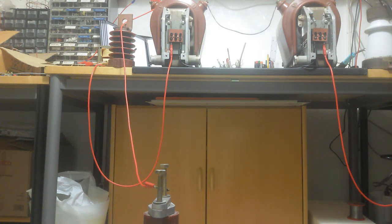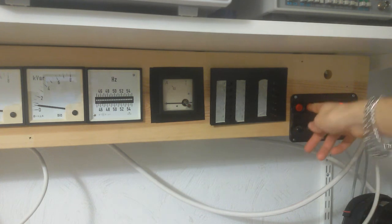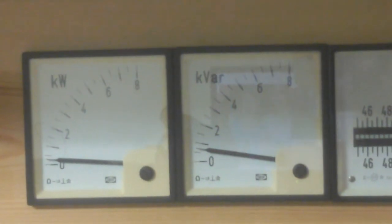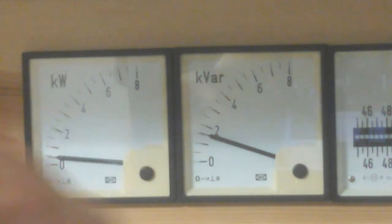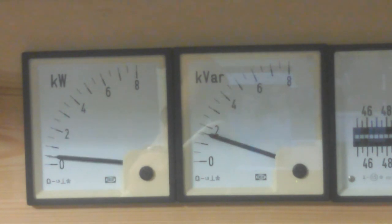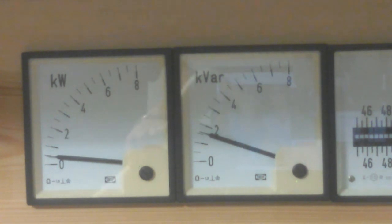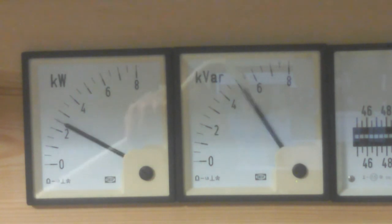And now they are turned off. Let's have a look at those meters. I'm going to turn on that one and then turn on that one — let's watch the meters: kilovolt reactive and kilowatts. That's another transformer — almost no kilowatts here, nothing. But look at that: there's a lot of wasted power right there. I'm going to pull the arc. And now I'm going to short it. That's a lot of reactive power that doesn't do anything useful — it just blows the fuse.